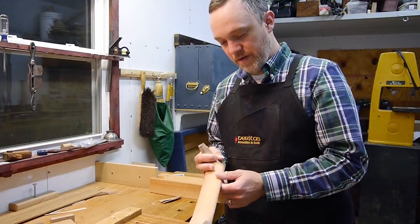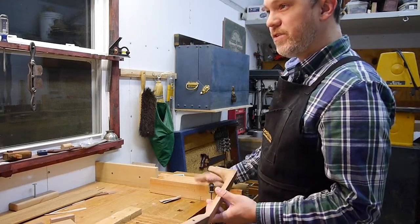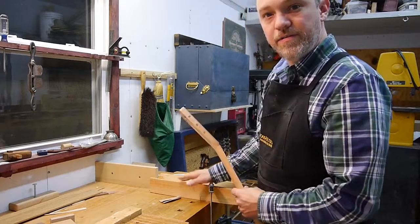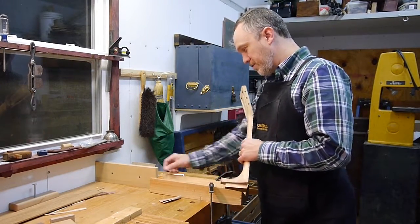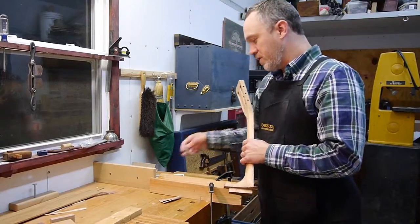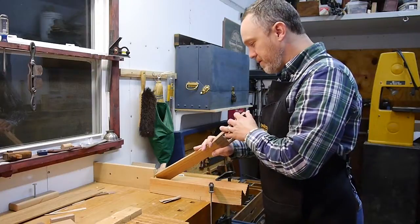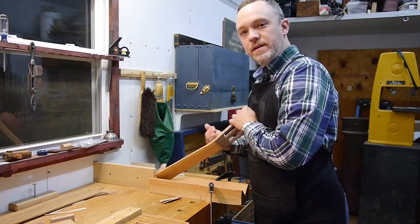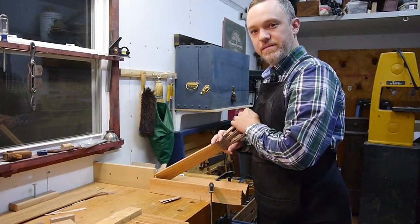This is one of my most favorite parts of making an instrument. I made my banjo and this was my favorite part. So I've just got something rigged up here — it's not very fancy. It's just like an old v-block that I've used for cutting on the table saw, and just something in here to push against. What I'm doing is putting this into the v-block — it kicks it over at an angle, and I can pull with the spokeshaves. Let me get you in a little bit closer so you can see what I'm doing here.